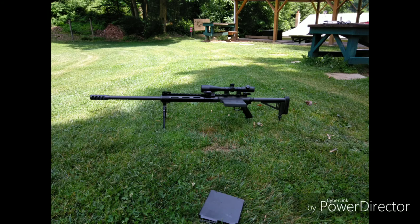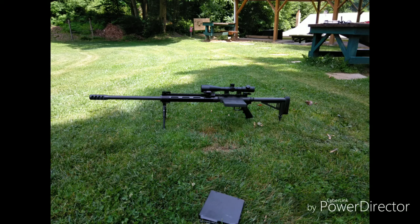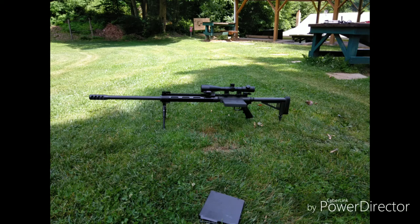The main purpose of this today was to test out the hammer spring. Since I've gotten the gun, I had previously fired 20 shots through it and roughly every other shot it would have a light primer strike and just not go off. And when you fired a second time, it would set it off.